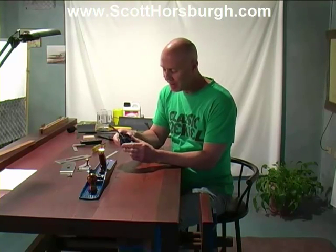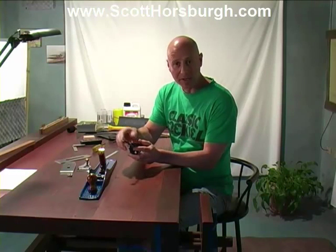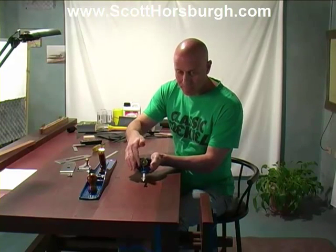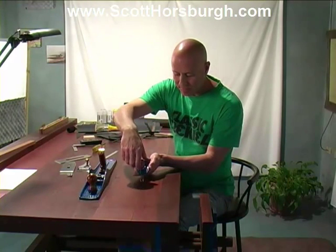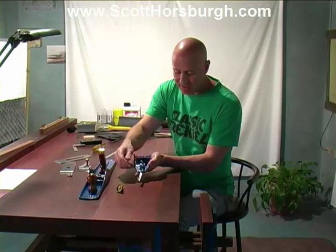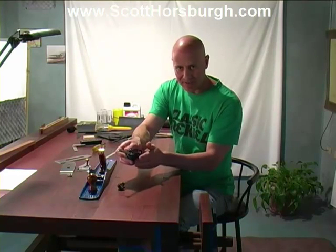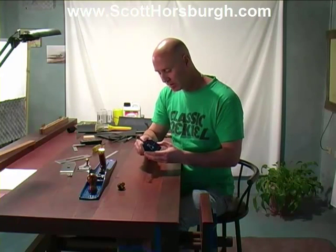So what I'm going to do now is remove this brass adjusting wheel and this Y lever will just fall away from it. So I'm just going to wind that right out, there you go, and take it right off so it's completely out of the way. And you can see that the Y adjustment lever there has just fallen away, and that enables it to fall back so that that surface is free. And I'm going to remove this screw that holds the blade and chip breaker in place.